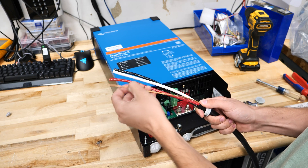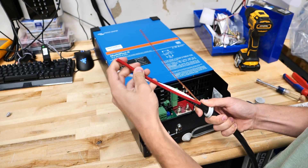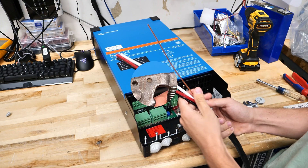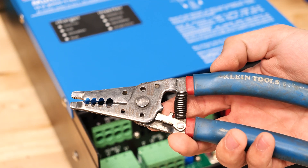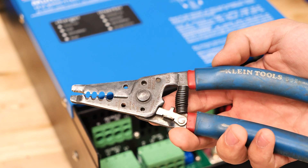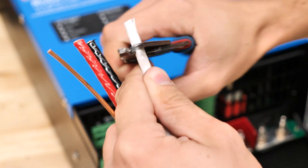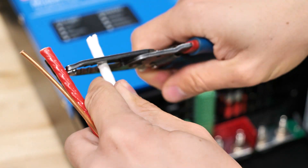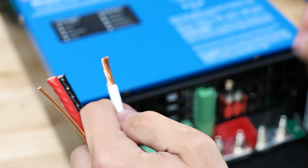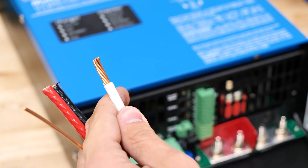So now before inserting this into the inverter, I like to straighten out all the wires just to make it easy. They're twisted within here, and that's okay if they're a little twisted — I just prefer to straighten them to make my life easier. To strip the end of these wires, I like to use my Klein Tools wire stripper. I've had this one for years, and my favorite part about it is it goes all the way up to 6 gauge. On these wires, we want to strip 3/4 of an inch of insulation — there's a red sticker inside the inverter that says exactly this. Now our wire is stripped and that's the proper length for going into the terminal of the inverter.